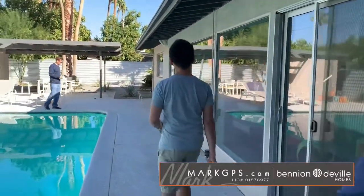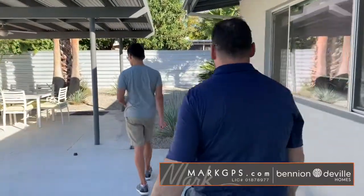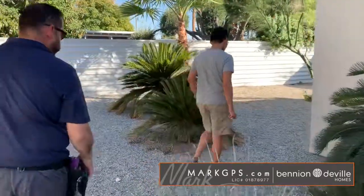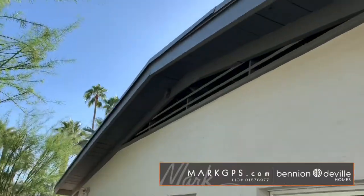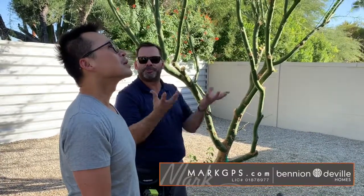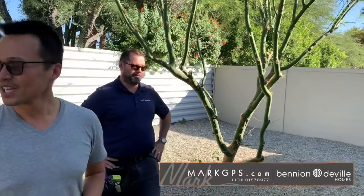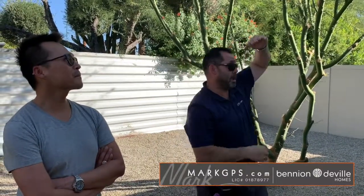On the other side of the house, what appears to be significant is actually just an attic vent. You need ventilation in your attic or else moisture will build up. It just needs a screen or something over it if you're worried about things flying in. There does appear to be a screen from the intake end where it scoops in.